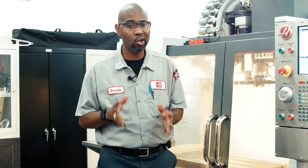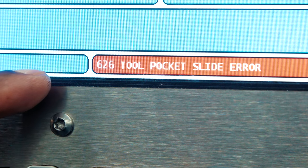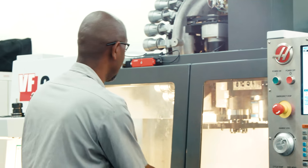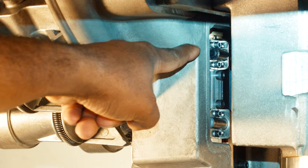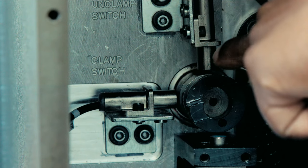The sensor is usually close to the thing it's sensing. Say you've got a 626 tool pocket slider alarm — you'll be looking for that sensor near where the pocket moves up and down. Or if you're getting an alarm 114 turret clamp fault on your lathe, then you need to get in the back of the machine and find the clamp sensor in the space behind the turret.